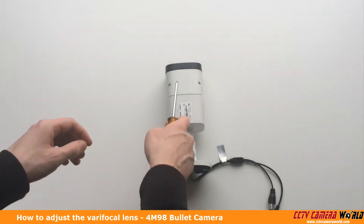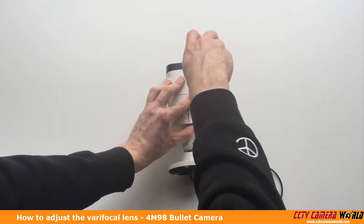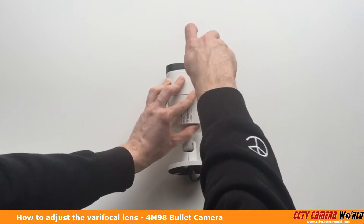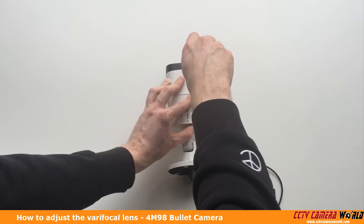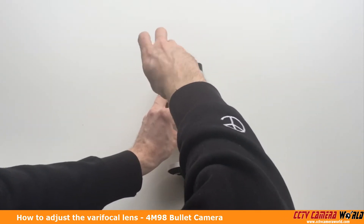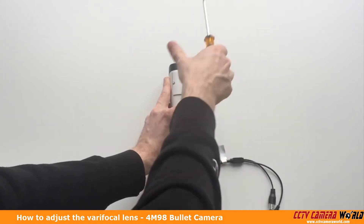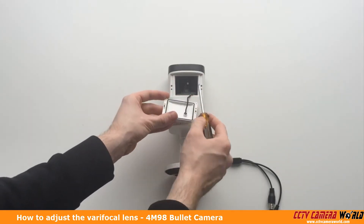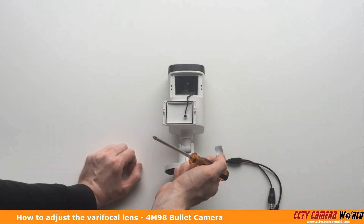First, you're going to want to loosen up and open the bottom compartment. This might be a little difficult to do. The reason why is that it's got to be very tight for water or any kind of weather — this helps with the weather protection to have it as tight as possible. Eventually they're just going to start turning, so you fit the washer there and bring up the compartment. You're going to see that it has a gasket and is also attached to the board on the inside.